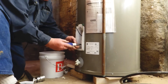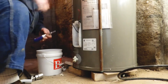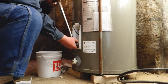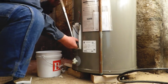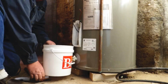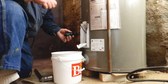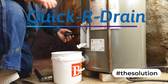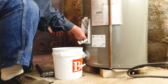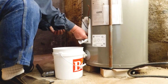So we're going to get to the element here, and we're going to pull this live. This water heater tank is full of water with an airlock. Okay, I've loosened this. Give it a couple turns down. I like that. And I am getting ready to remove the element with the other. The water in here is good and hot, so I'm going to be a little careful.